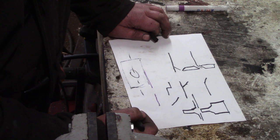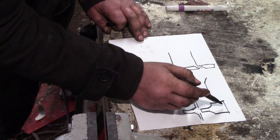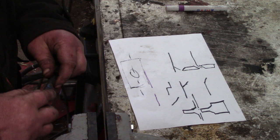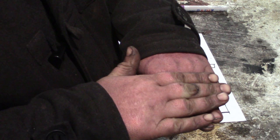Yep. There is another sort, the dimpling pliers, the stuff that we use on countersunk rivet holes, and they're quite similar to this, I suppose. But rather than hitting it with a hammer, because they're made for very small holes, like 1/8 and 3/32 holes, you just squeeze them with a plier, and it will make the little dimple. A much better way of doing things than countersinking, because you normally put the two sheets of metal together and dimple them together, so it gives the joint a bit of strength, because they don't want to slide apart, and on top of that you don't remove any material.